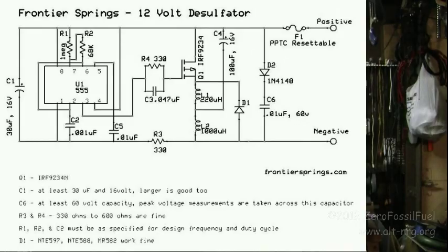For those of you who have ever tried to build this device and failed miserably, I can tell you I know why. If you look at the schematic diagram and specifically focus in on the power MOSFET, I looked at that for quite a long time and said to myself: how is a P-channel power MOSFET going to operate from a negative ground system as a source follower? I thought about it and said I'm just going to build it the way the schematic is shown and see if it works. The answer, of course, is it can't work. A P-channel power MOSFET cannot operate as a source follower from a negative ground or positive supply.